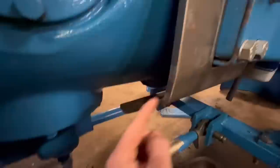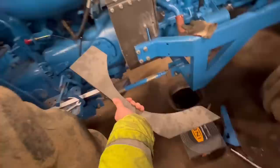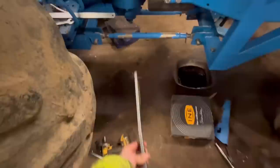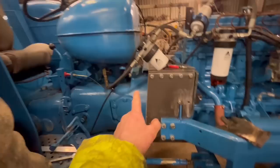And then with this bit that I've pressed, I put a straight edge down there and measured across from the straight edge on how much it goes in. Same with there. And that's just the easiest way I've found of getting a pattern like that. Sometimes I'll draw a cardboard pattern, depends what I'm doing, but stuff like this, I just do it off measurements. And because that edge is not straight, I have to put a little bit of a bend on it. The reason I didn't make it straight is because I wanted it a bit wider where it goes past there, but I didn't want it too wide at the top because I didn't want to disrupt any of that bracket or anything. So that's why it's like that.